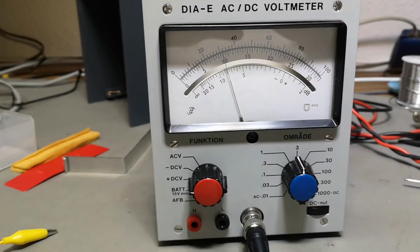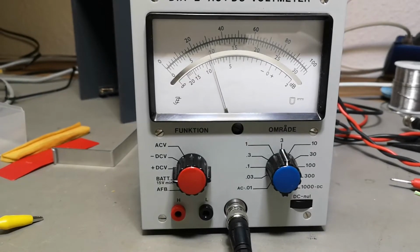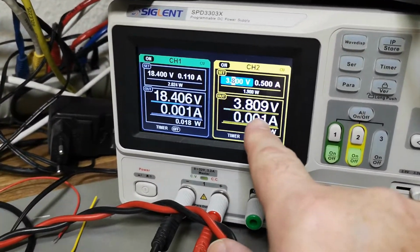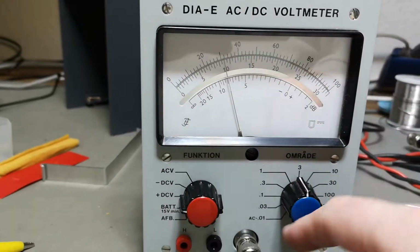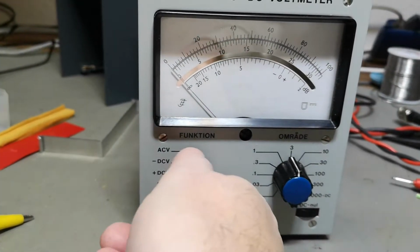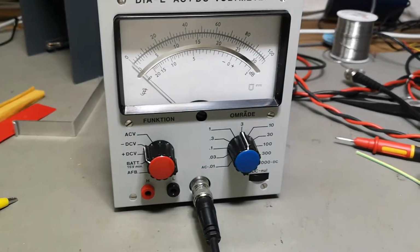Cool. Let's try and be real accurate here. Offset. Input is now 0 and input is now 1. And it goes to 1. All I did was to trim this and the offset between that one and the chassis. So that will force the 0 input to go to 0 here, right? But also, see, there's almost nothing now. That is good. I'm super happy now. But I don't have a schematic, so I need to figure out where this offset is coming from.